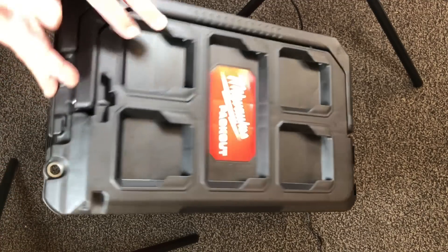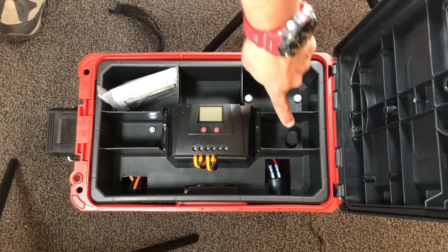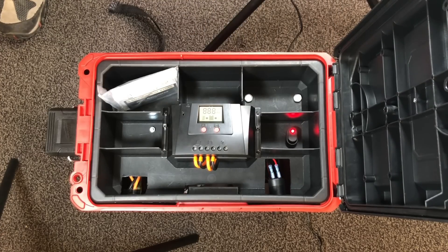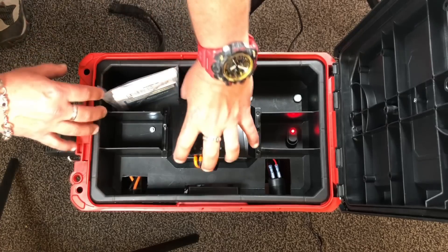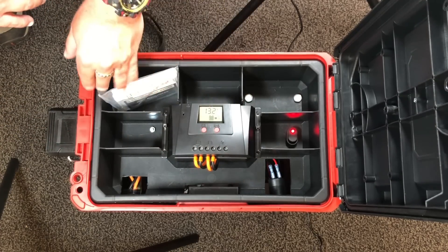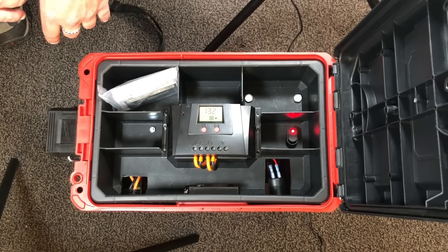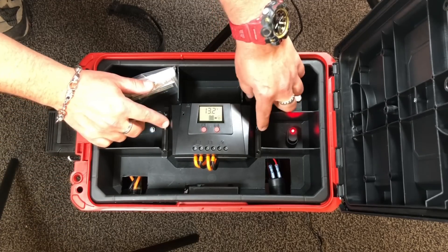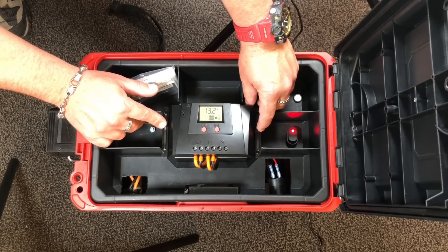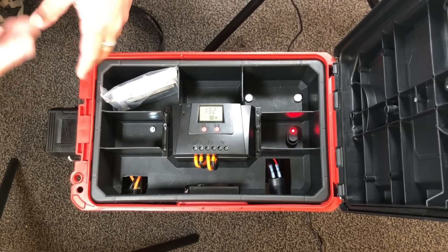Taking a look under the hood: in here we have a 20 amp solar charge controller, and right here is the switch for it. You have to have a switch because if you just hardwire it to the battery, it'll just constantly stay on. This box originally had plastic covering this area, so I had to Dremel it all out so I could drop the charge controller in there. I don't like to put them on the front or the side of the box — I try to keep things tidy. I secured these with a couple of zip ties and drilled some screws into the plastic, but it seems to hold really well.